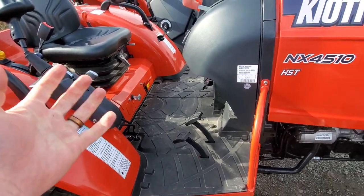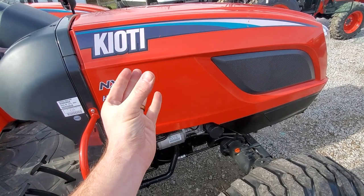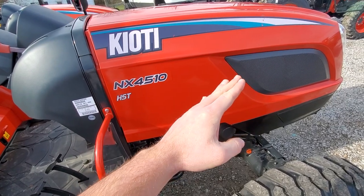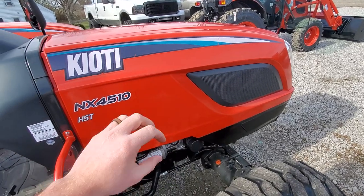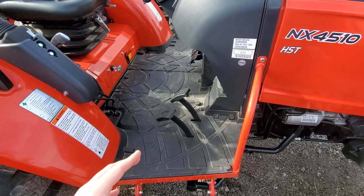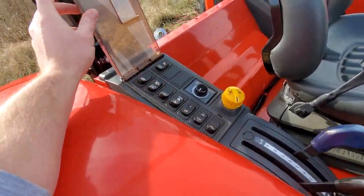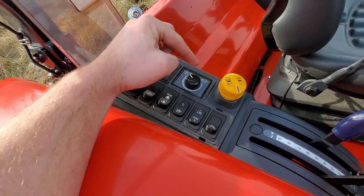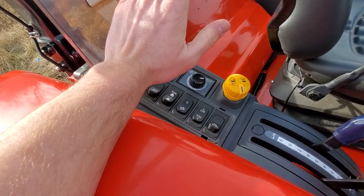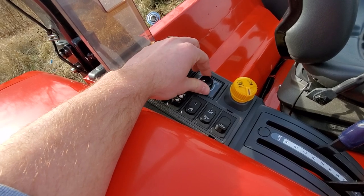The controls lead to a little control module that runs back to the transmission and tells it what to do. Because it's drive-by-wire, it has an absolute ton of features as standard equipment. For example, if you put cruise control on that DK, it's a little mechanical linkage you bolt under there and wire in — when you hit the switch, the linkage snaps magnetically to the actual rod for the hydrostat to hold the pedal down. But because the NX is driven by wire, you can do all those things electronically. This panel has an absolute ton of options. The main one is a knob that controls how sensitive the hydrostat is — put it on a light setting and you can mash that pedal and it'll just gently move; on the max setting it'll give you torque right away.